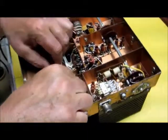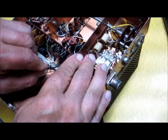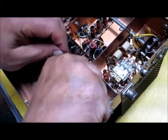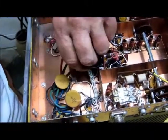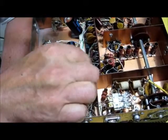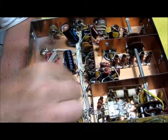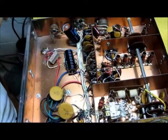I'm going to have to solder these leads together because the lead on one capacitor is just not quite long enough. So I'm going to pull the sleeve off a little bit, cut it, and put it down there. Well, guess what — that was not a good solder joint from the factory. I can see it kind of let loose up there, so I'm going to have to solder that. That's a problem.